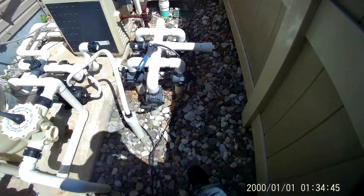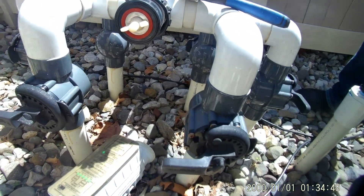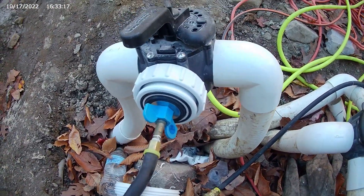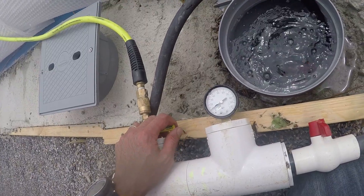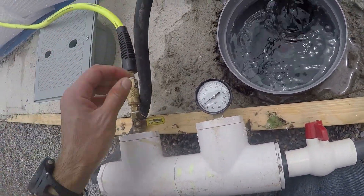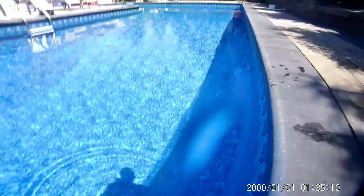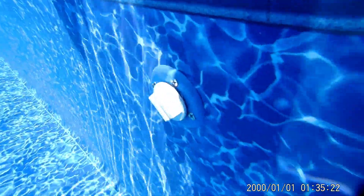If you are dealing with more complicated lines and connections, you can simply apply pressure with air on one of the suspect lines — preferably from the equipment side — and observe the bubbles coming into the pool. Then turn off the pressure, plug the lines where you saw bubbles coming out, and try again with lower pressure. Repeat the process until all the connected lines are plugged.